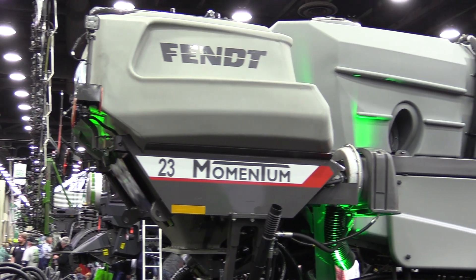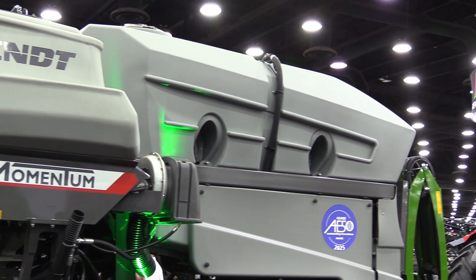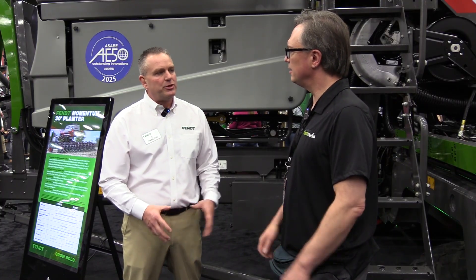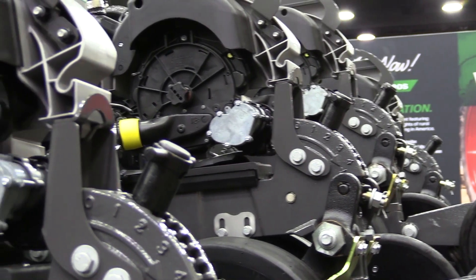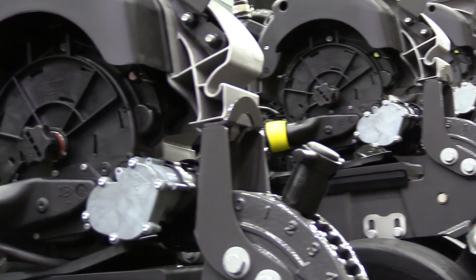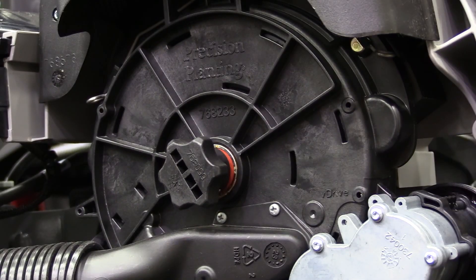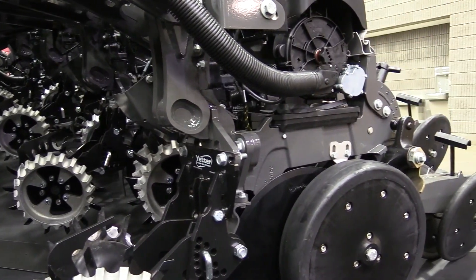We've done all that with the 40-foot and the 60-foot, and now we've brought it to the table with a 30-foot, getting down into a 12-row or — like this one — a 23-row. It's a split-row system on this planter too. With the VCT that's on here, just like the bigger planters, it's got 52 inches of travel. So in those smaller fields we're still able to travel more terrain, and by doing that we keep those row units in position to get the seed in the ground and have that good soil-to-seed contact to grow the plant the best we can.